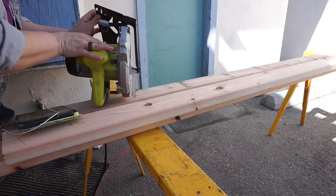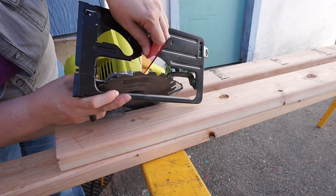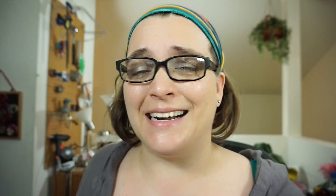Step 3: Try it with a circular saw. Step 4: Don't use a digital angle finder. Instead, laser cut a small piece with the exact angle you need to set the circular saw to. Actually, this part did work well, though it took a little longer.